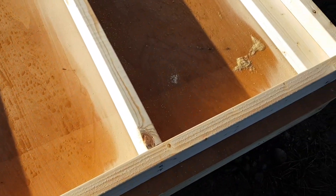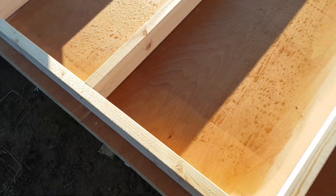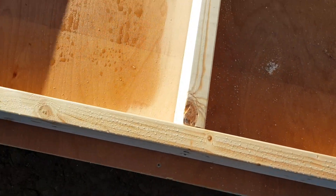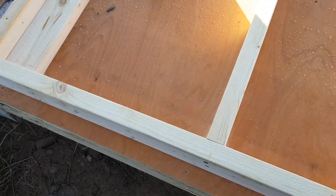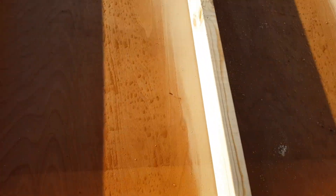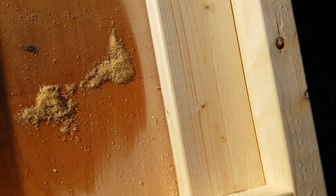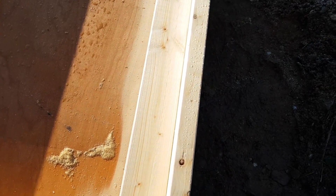If you're not familiar with how to frame a wall, it's pretty easy. Literally work out what size wall you want, build the square for the outside, then every 2 feet — 2 feet is sort of construction standard — space pieces going upwards. We've also put pieces on the inside so when you join the next wall on the end, you've got something on the inside to screw boards or plasterboard to.